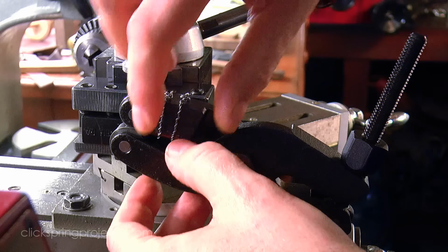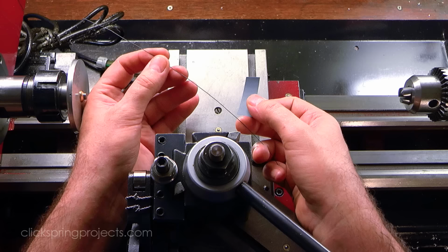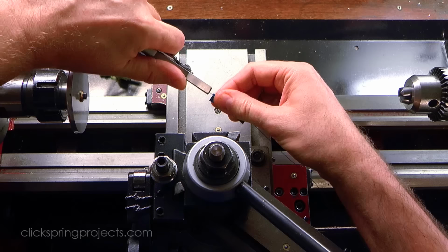The final condition of the rolled wire, and in fact the final spring itself, depends a lot on the initial condition of the raw stock before rolling. In particular, the wire needs to be completely free of oxide and in a well-polished state.